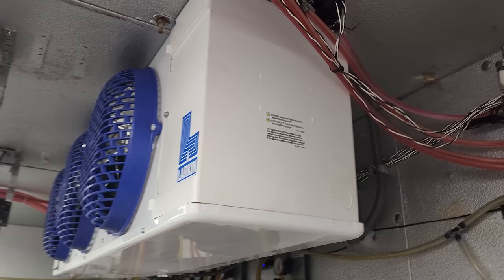We're going to wrap this one up. Not too bad. This wasn't a full system replacement — I would have loved to change the line set, the VAT, or the condensing unit and convert the refrigerant over to 448A, but that's not what the customer wanted. This particular customer just wanted to change the evaporator coil, so that's what we did. It was a leaking evaporator coil, so we utilized the existing lines, made a new connection, and did add a new P-trap. When you're doing the intelligent stuff, as I mentioned, I had to have the electrician get involved because you need an independent power source, unlike the old equipment where the evaporator was controlled by the condensing unit.